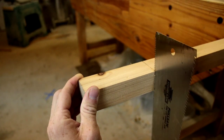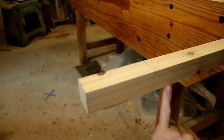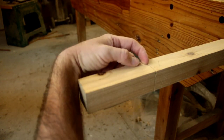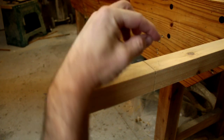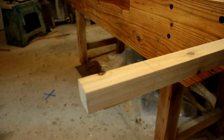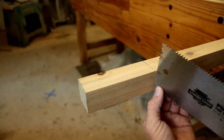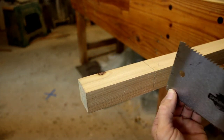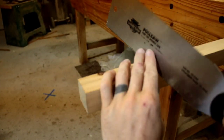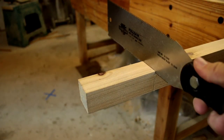I can guide where the groove is, and now I have a groove following this line. If you think about what the wood looks like on the inside of this groove — we have a flat spot here and a flat spot here, and that makes a point. Your goal is to always cut the point. If you keep cutting the flat, you'll get halfway through and your saw will stick. When you push it forward it's going to do this a lot, so always cut the point.